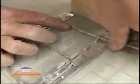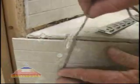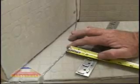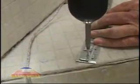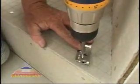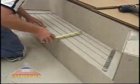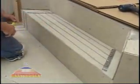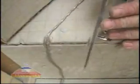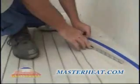If you'd like to add heat to a step area, run the heating element up the riser near the corner. Cut a groove at the corner and secure your wire with hot glue. Measure back several inches and secure your first strap in place. Go to the other end of the tread and secure your other strap. In this case, we're stringing the wire in place between the two straps on 2.5-inch centers. And then, because we have extra wire, we're leaving the tread by making another cut at the corner and then running down the riser.